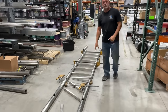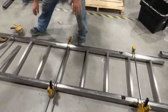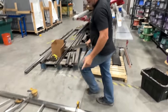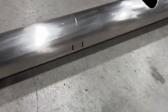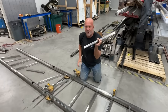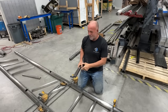And the way we did this is we threw it all in SolidWorks and kind of followed it up to the top. You're going to notice that the ladder legs, I've still got to square it up, are actually keyed in. If you look at that, it's got the radius of the 3-inch, 3/8-inch thick stainless steel. And you can see here, there's little slots. So this actually notches, slots in, you open it up, you clamp both sides. It's a very heavy cage. It's much stronger than any ladder ever needs to be, except this is serving two purposes.